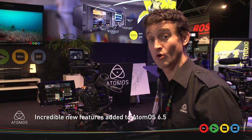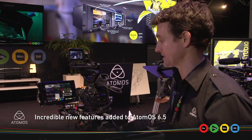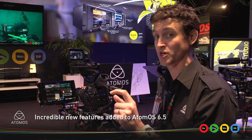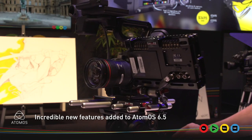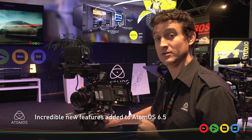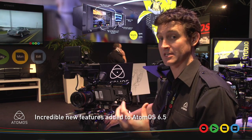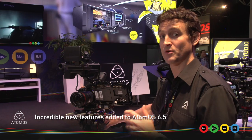So that's the SDI RAW C500 and C300 Mark II, but that's not all we've added in OS 6.5. Outside of that, the SDI RAW recording is only for Shogun. Another feature that's only for Shogun with OS 6.5 is LTC input. We're now utilizing the Genlock input to also allow you to use LTC. In playback we'll still use Genlock, but in recording you're able to use LTC for timecode — that's an upgrade unlocked with OS 6.5 for Shogun.